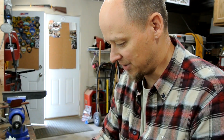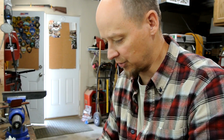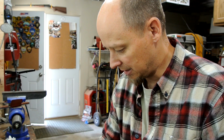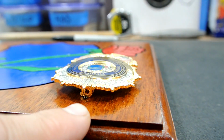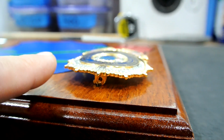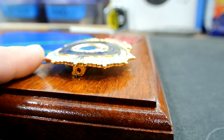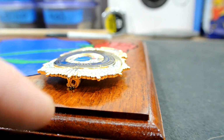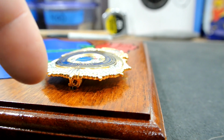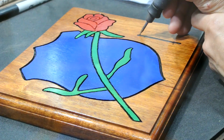And as I'd mentioned about the pin being able to sit a certain depth in there and have the shoulders, I'll see if I can get you guys down here to show you what I'm looking at. The pin has just enough to go down into so I can epoxy it all, and then the badge will rest flat on here. So I think I'm going to be safe. So all I have to do is router or Dremel out that little groove, that line that I made, and the badge will be able to set in place.